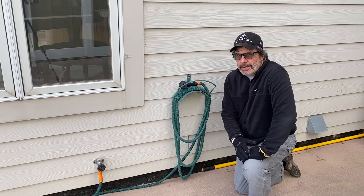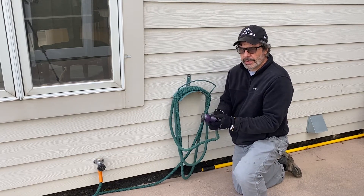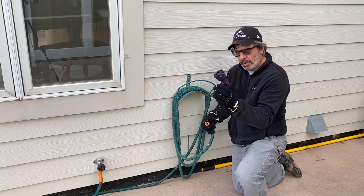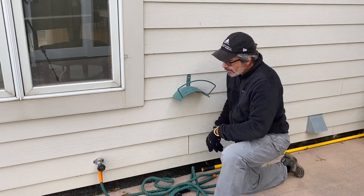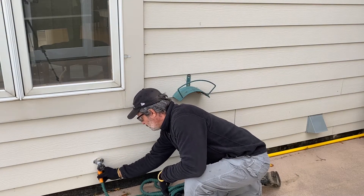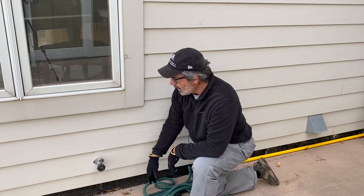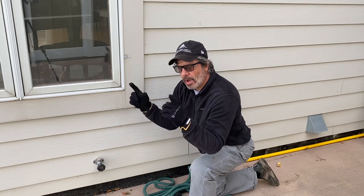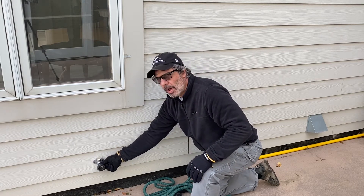Let's do the easy ones first — outdoor hoses. Pretty simple: you always want to unscrew your hose nozzle from your hose, because water builds up in there and if you store these outside in the winter they'll freeze and break the nozzle. Then I disconnect my hose from the hose silcock. Now this is what's called a frost-free silcock — it's a long metal tube that actually shuts the water off further inside the house so you don't get water freezing out on the outside.